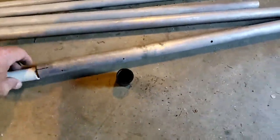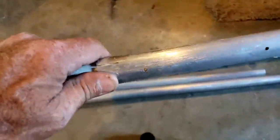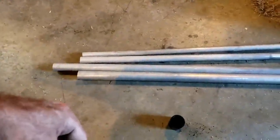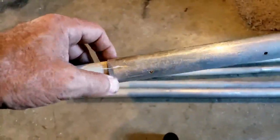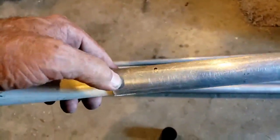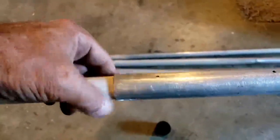As you can see, I have a slice in the pipe so I can put a clamp around. I still have to slice the other pipes to do the same, to clamp the sections together. But at this base one, the clamp will also be holding the center conductor from the coax to attach to the antenna.